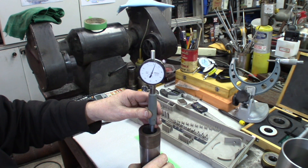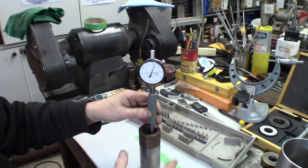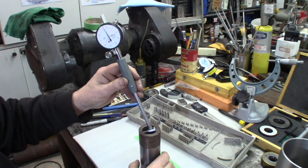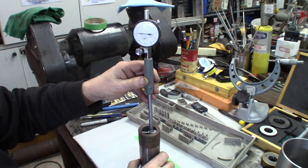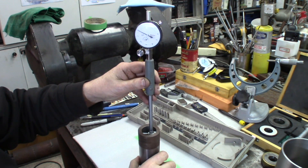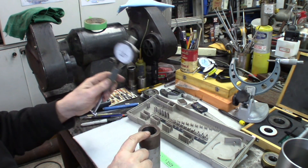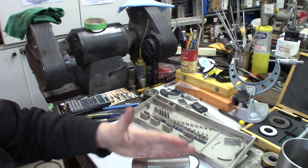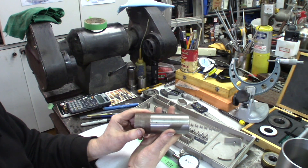When you bore something, always use the full pass — use the same tool pressure all the time — because you're going to get something very irregular. We can also measure: let's go back to the first part and measure if the cylinder is round or has an oval shape. Turning about 60 degrees each time — this cylinder is very round on the surface, except it goes a little bit as a cone or it shrinks down because of the poor boring method I just explained.